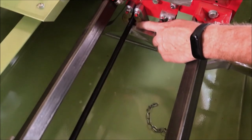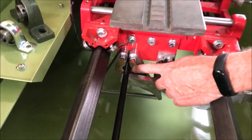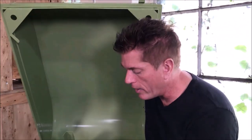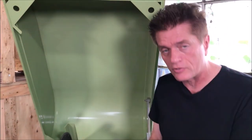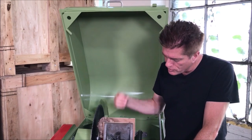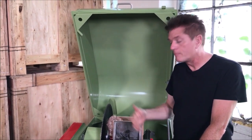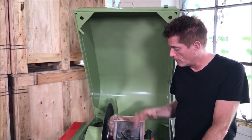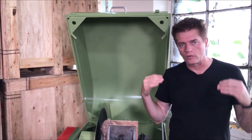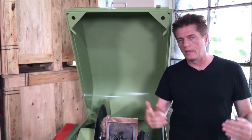We've improved a lot of the functionality, like here, the wear part. This is a replaceable insert, which has double the amount of thread that the original Highland Parks had. It's a classic problem with any saw that you're going to wear the feed nut out. Ours is a simple 6-screw replacement part. I think it's like $40, fairly cheap. That allows you to service a saw simply and be up and running without a lot of delay. Our attention has really been on how to make a saw that's extremely rugged, extremely durable, something we can be proud of because we live cutting every day.